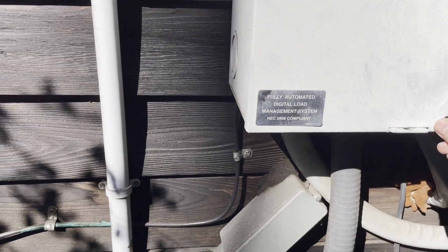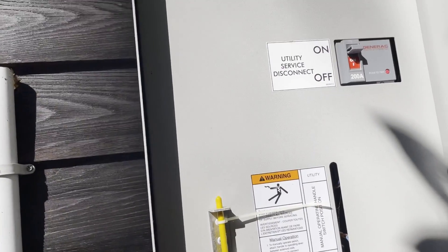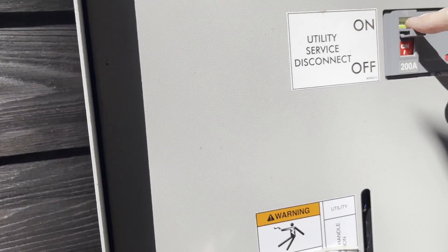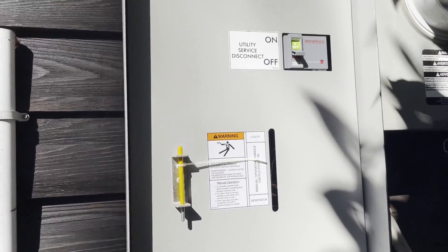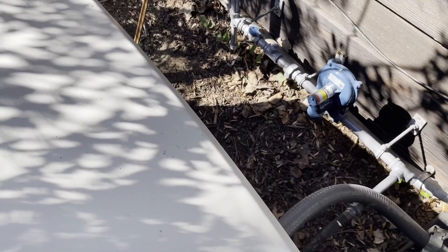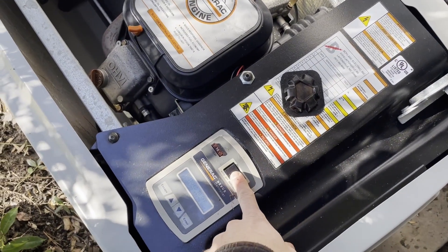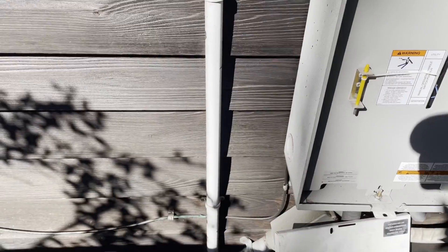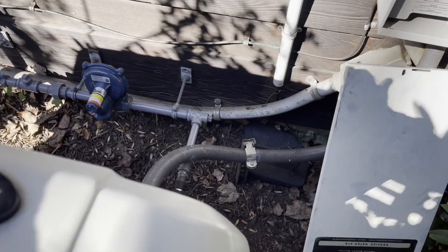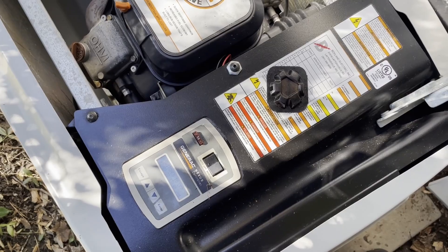Lucky for me, I have a whole house generator here, so it's easy to get to the service panel. You can actually turn this off and have a whole house utility disconnect. By turning that off, I can turn off even the source power into the house. If you happen to have a generator like this, make sure that's in the off position as well so it doesn't kick on. Being doubly safe - it's not going to turn on to its test phase and start generating electricity.